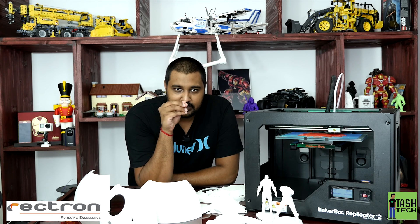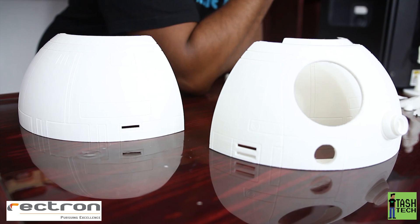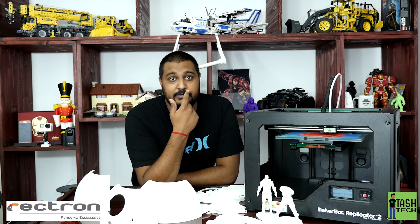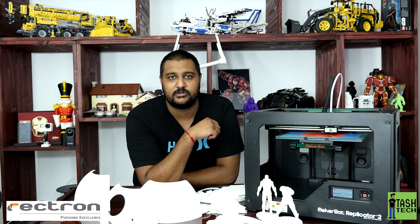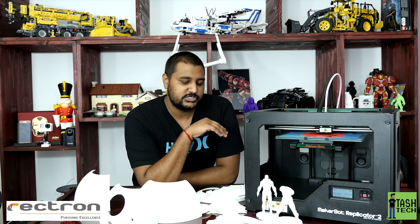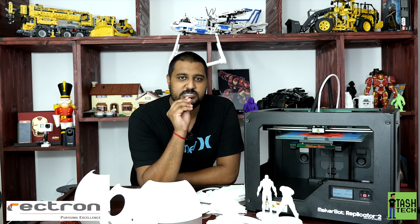The other issue I had was the temperature. When you select the 4th generation MakerBot printer it sets the extrusion temperature on PLA to 220 degrees. If you watch when it lays that raft, you'll see the plastic will actually bubble a little bit and then pop. I always thought that was the filament, but we have top grade filament. So I stopped the print, adjusted that to 215 degrees like the default on the MakerBot 5th generation, started printing again, and that was solved — no issues.